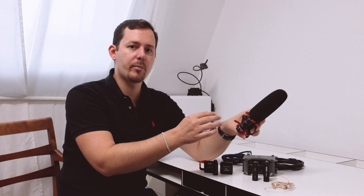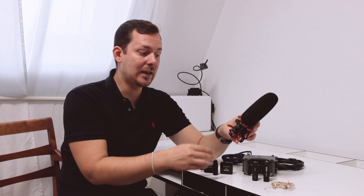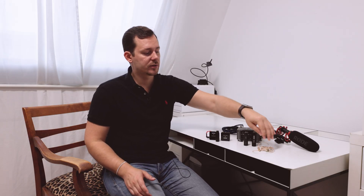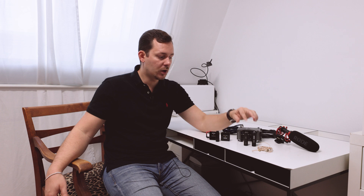When you can turn on the microphone manually and completely, this adapter is totally fine. But it's a wholly different story with microphones like a Lavalier, the Rode VideoMic GO 2, or the Rode VideoMicro. Those microphones do not turn on by themselves, they do not have a power source, and they rely heavily on the power provided by the camera or the audio recorder. For those, you need a device like this.